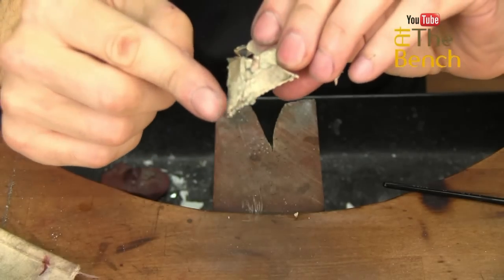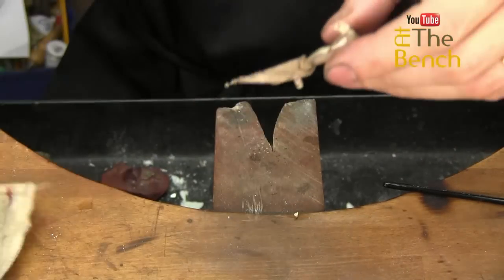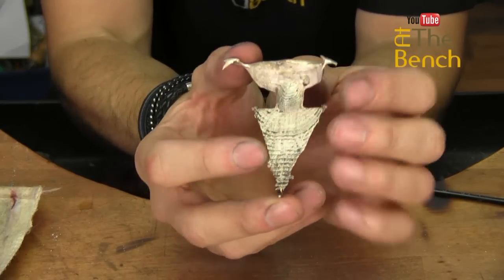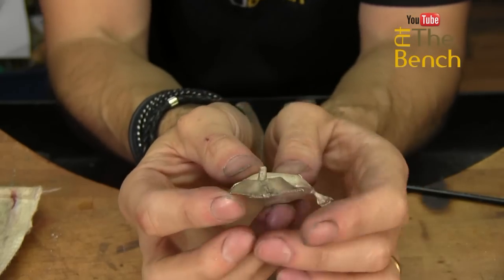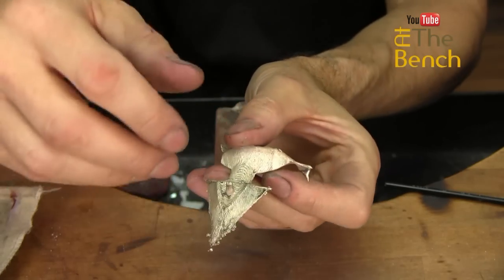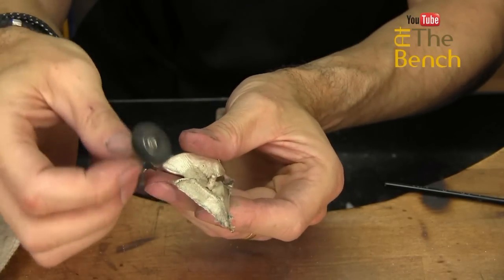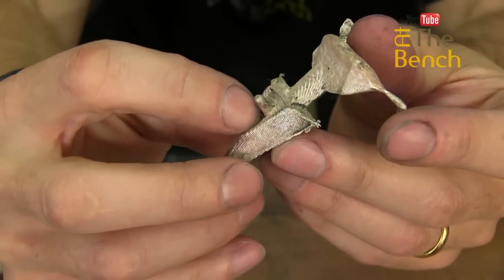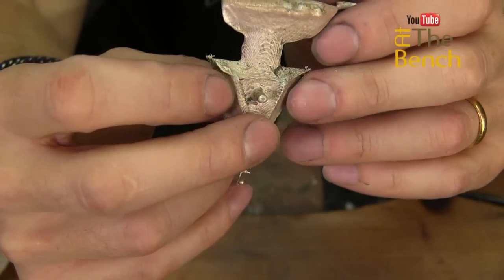You can see the areas that we carved. I pushed the handle of my needle file just a little bit too far into the model, so I may just have to cut that down a bit. I'm surprised how well that has actually come out. You can see the design and the pattern upon the back — you can make this as neat or as rough as you want to. Because we've got this little area here from the pouring channel, I've simply drilled a hole across the width of it, and from there we can put a chain or even a nice black leather thong — as I've done with the others.